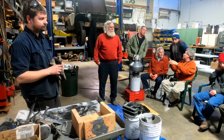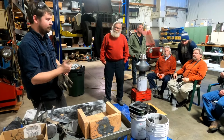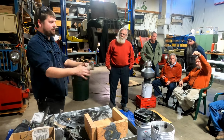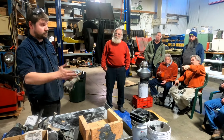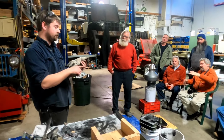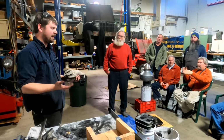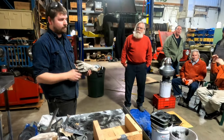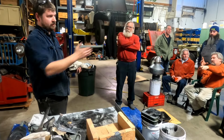So you have to test your metal every so often then? Yeah, so you have two options. Well, you've got like three options, right? One is you don't care, which is what most art foundries do. They just keep melting and melting it. Then they go, well, why does it not pour as well? Because when you lose your elements, sometimes you lose fluidity and it pours like sludge. And you're like, I have to keep going hotter and hotter and hotter to make the same casting. What's going on? You can test it, or the solution to pollution is dilution.